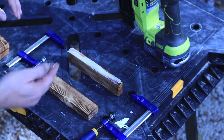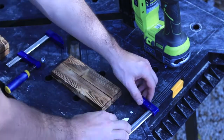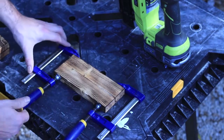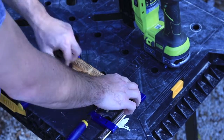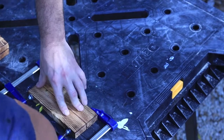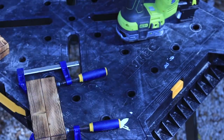Take your seven inch pieces and glue and clamp them together. Be careful about how much glue you use because you don't want over-squeeze, but if you do just take a damp rag and wipe it over and that'll get rid of it. Glue them, clamp them, and then shoot some two inch brad nails through on both sides. Repeat this process until you've got three of these pieces - these are going to be what the actual watches rest on.